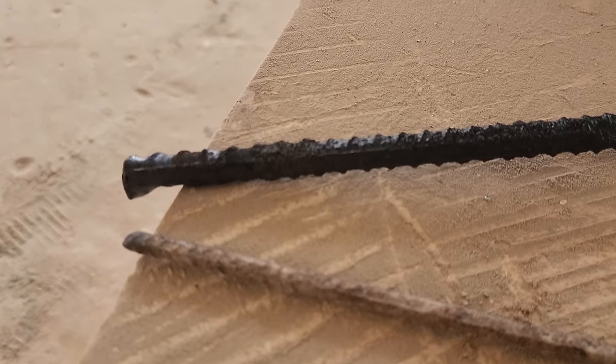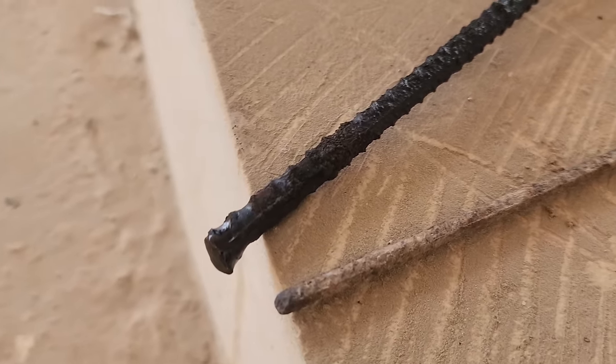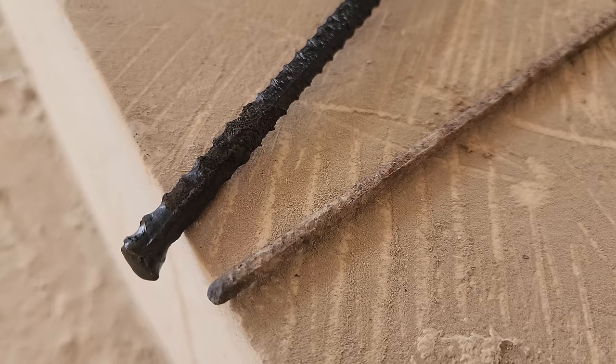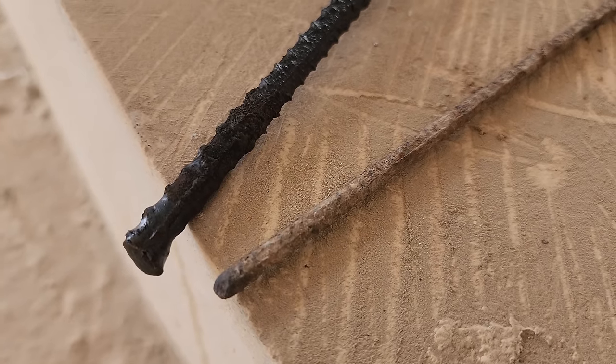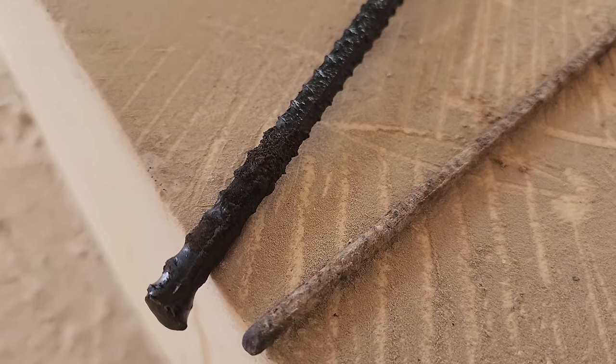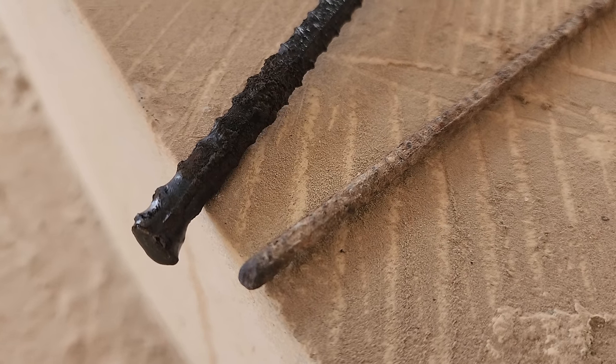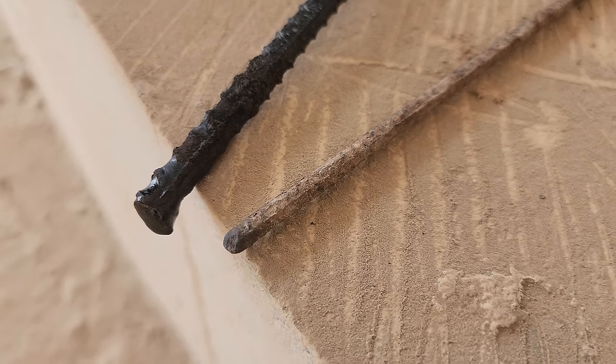Okay. Here's the iron rod we were using, and it didn't get eaten up hardly at all. So I'm wondering if there might not be very few sulfides in there. There may be mostly oxides. So we'll find out on this test. If there's no matte layer, we'll be home free.